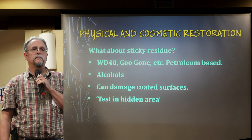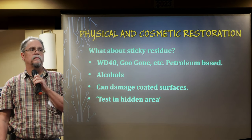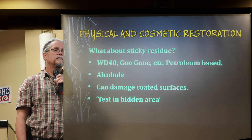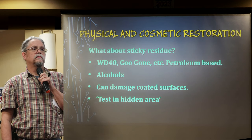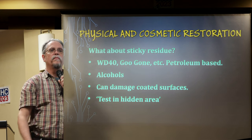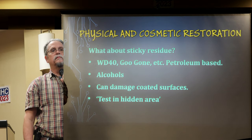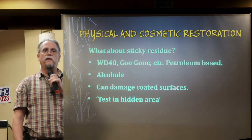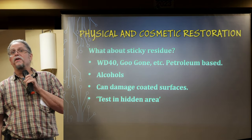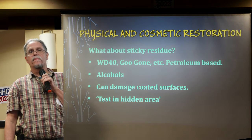Then you have the problem of an oil film which you still have to wash off — with regular detergent, or even better with no residue: household clear ammonia. That's an excellent mild solvent for things that alcohol or mineral spirits would help with. Gasoline can be good for greasy metal gears if you want to remove a sticky thing, it's fantastic.